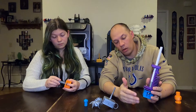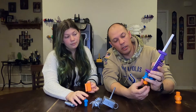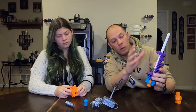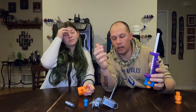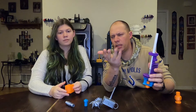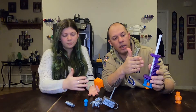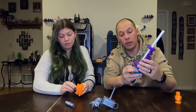You'll notice that this hole is a lot bigger than the PTFE tube, however it slides right in and stops right there — so it doesn't go all the way down. When you get everything hooked up and heated up, this tube doesn't come all the way down. It heats up through the heat break and once it hits the heat sink area, the fans blow and pull the heat away. That keeps the PTFE tube from getting hot and starting to degrade — which is good.